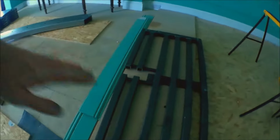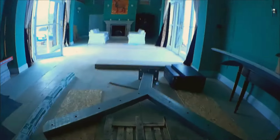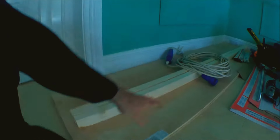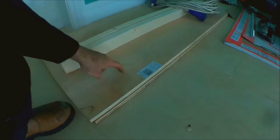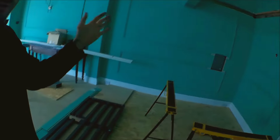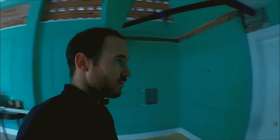So here's the platform that's got to be welded onto the top. Those are the steps. All of these steps should slot in nicely into these holes, and hopefully all the glass, which is already being cut, should fit also. What I'm going to do with the glass is I've got these boards here. I'm going to go and find the glass that's in another room. I'm basically going to lay the glass on top of these boards, find out where all the fixings are, and then mark those fixings out and drill holes. Every time I weld a step onto the frame, I'll also bolt it to that piece of wood, and that should keep everything exactly in line for when the glass goes on. So we're going to get the steel work in first and then the glass on top.